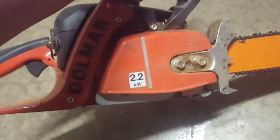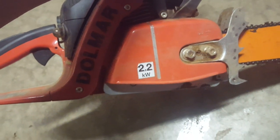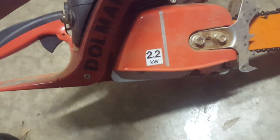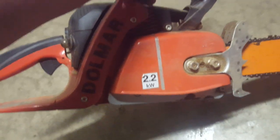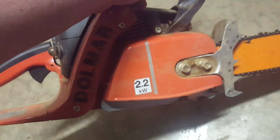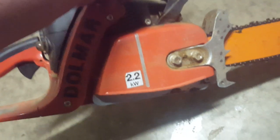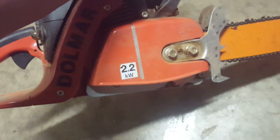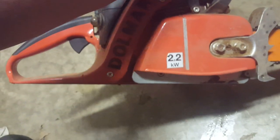The exhaust on the 421 has a catalytic converter muffler. If you know the right dealers you can actually get a European muffler, which has no catalytic converter — it's just an open box. It comes with a drum sprocket versus a rim drive, but that's a really easy switch. I've switched it out to a rim drive because I also run a 0.325 chain — so I can go from 0.325 to 3/8 low-pro back and forth fairly quickly.